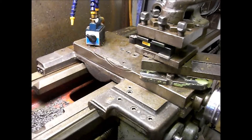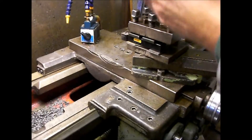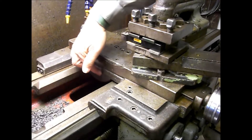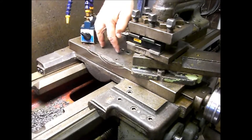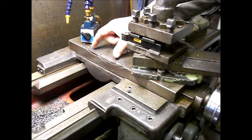I've been doing some scouting here to find out how I should make this follower rest, or what we call it, traveling rest. I realized I have to mount it down here, so I have to drill two holes. I'll take an angle iron 10 millimeters thick and make a bracket up here, then mount the follower on top of this. I think that's the best solution.